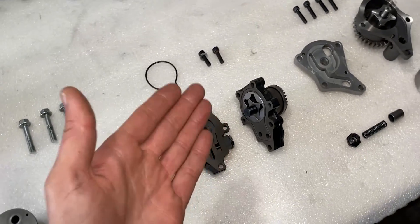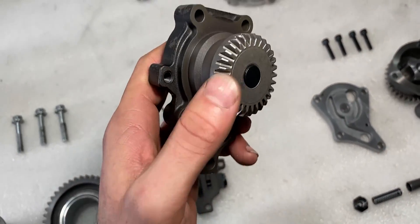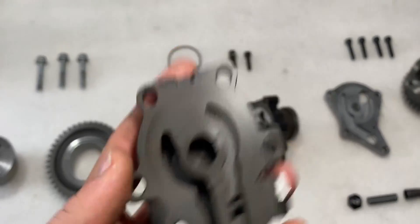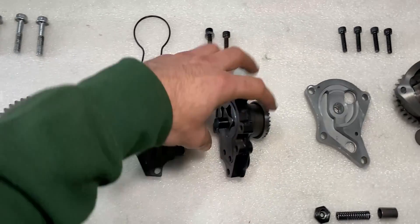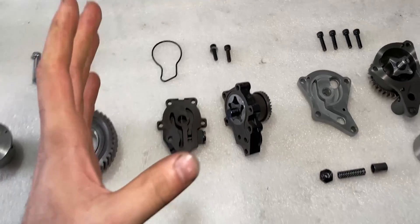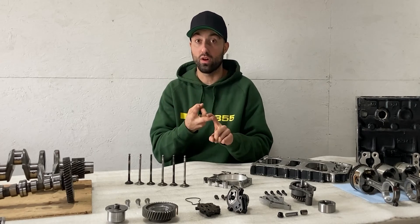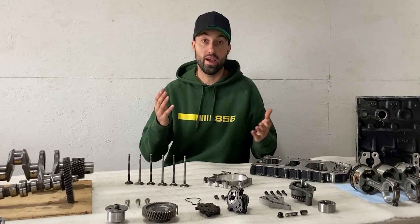Over to the fuel pump — this fuel pump looks identical to the oil pump but it supplies fuel to the injection pump, and it's also driven by the injection pump off this gear. For some reason the John Deere 1445 came in with two pumps — this one appears to be the original, and they also put a brand new one onto the injection pump. The surfaces on this pump are much better, the gasket is still in one piece so it probably wasn't leaking, and the inner and outer rotors inside are in great condition. I'm not exactly sure why they swapped it out for a brand new one — maybe they had an issue with their fuel supply. I'll figure that out in the near future if I go ahead and start it up and it doesn't start.